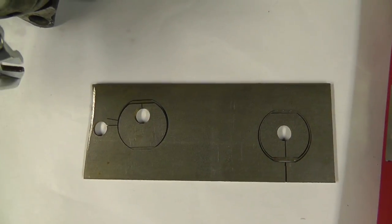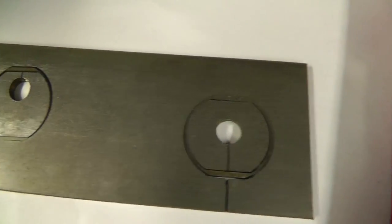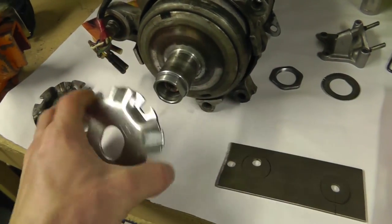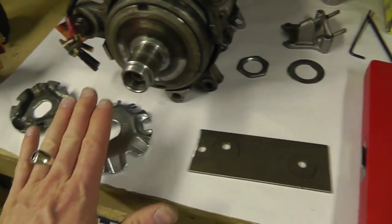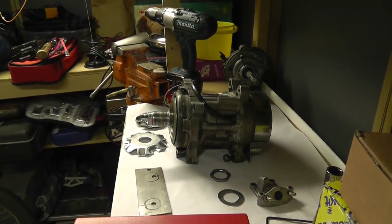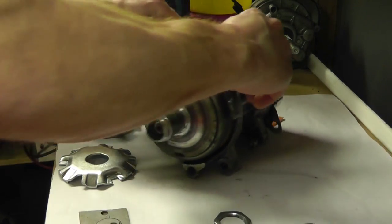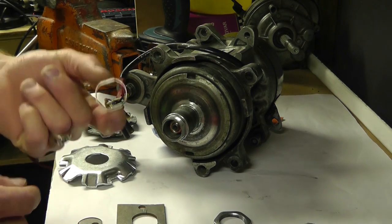You can see the differences between the two cuts. I redrew it at a slightly different tolerance to make sure my drawing was more accurate to my part. I measured the diameter and drew the drawing exactly to fit with no slip — I did not allow for any play or any room — because I wanted to see how accurate I could cut this part.